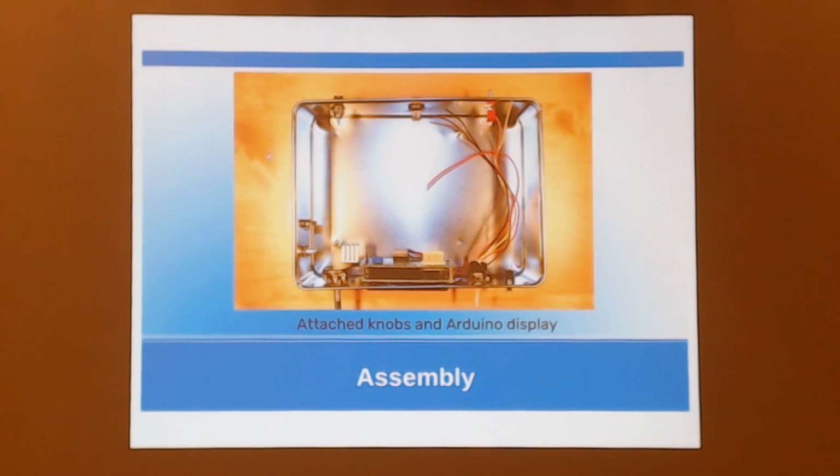So this is the box, some wires. The BITX40 is a 40-meter sideband, 5-watt transceiver, and it comes with a voltage-controlled oscillator, controlled by an Arduino. Ashhar Farhan in India designed this, and he calls it a Raduino, R-A-duino. Very cute. So it controls the oscillator, and then it connects to the main board. That's $50. For $50, you get zero protection.